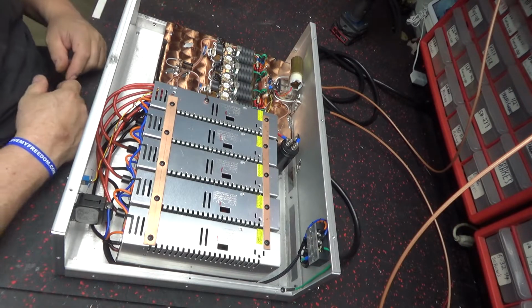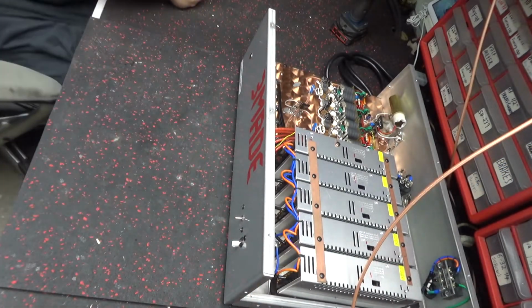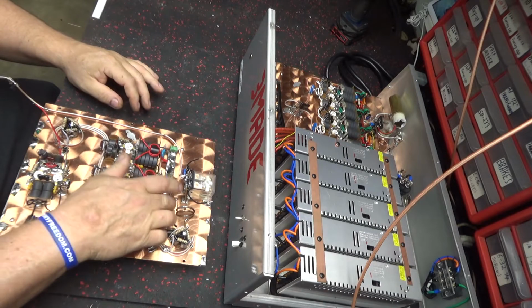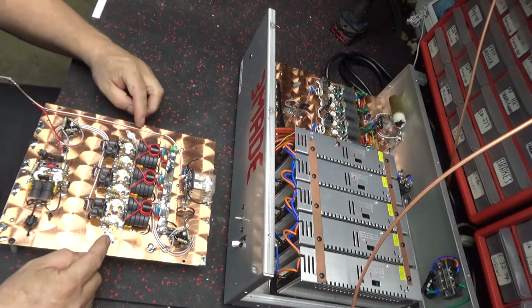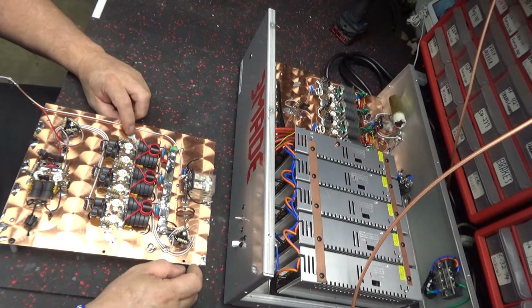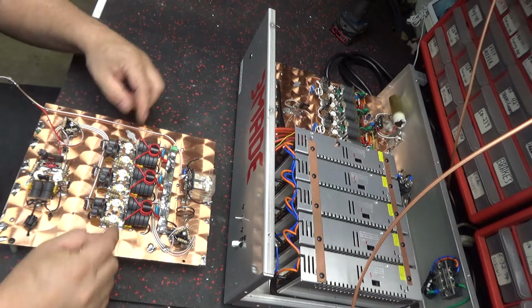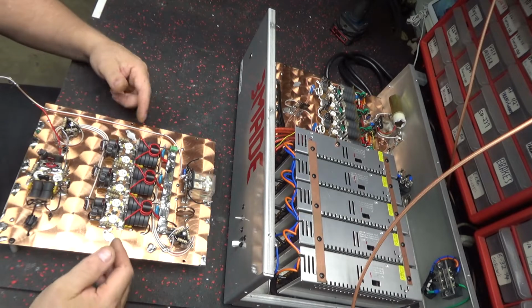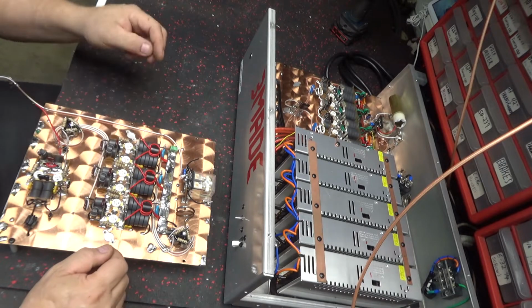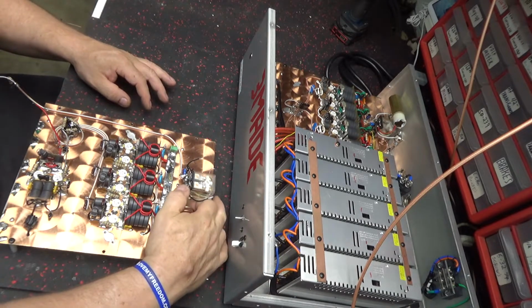When you build a 6-pill, sometimes we put these, if we know they ain't gonna be left, see, this could never be an 8 because there ain't no power supply in it. 2x8, anyways. You know, I could have put 2 more transistors in it and slid everything over. So these 2 would have been 1, these 2 would have been 1, these 2 would have been 1, and them 2. And that would have made 2x8. But ain't enough power supply to pull it.